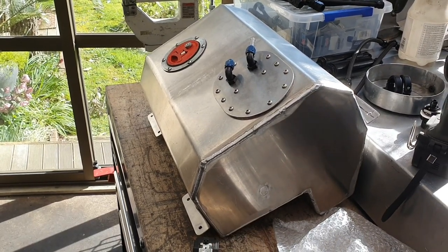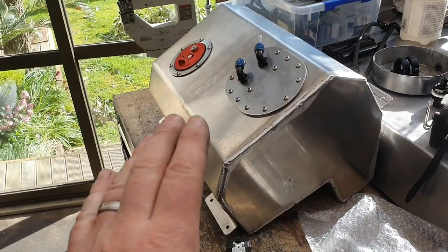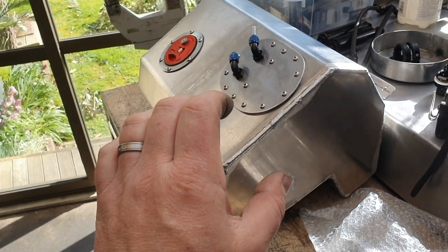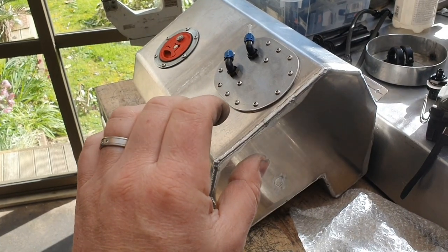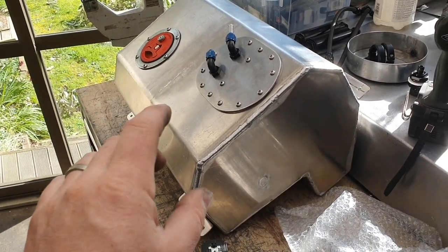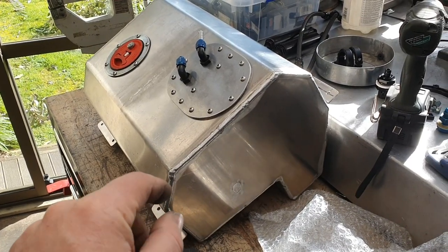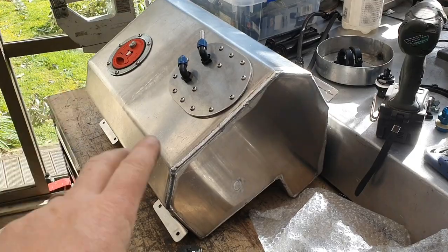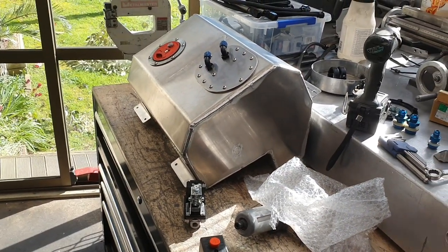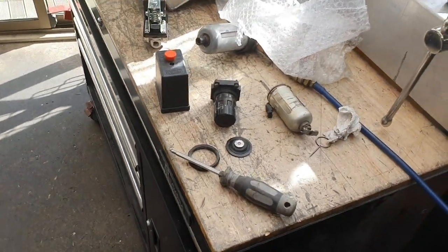Normally we'd fill this up with water first, and we'll probably do that. The reason you do that is there's less potential energy — you can't compress water here on earth at normal operating pressures. So it doesn't want to expand back out if there's a crack. But you can compress gas, so if you compress everything in here to 7.25 psi above atmospheric and crack it open, there's a whole lot of stored energy that wants to get out and it'll literally blow the building off its foundations. So we'll either do that outside or fill it with water first.